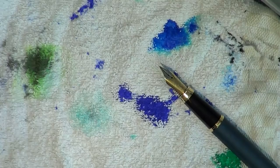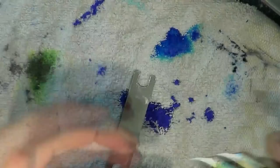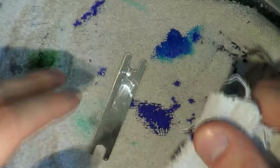Ideally, you would like to end up in a situation where the .002 inch shim is held in the nib slit — just held in there without falling out, which seems to be the case here. And yet, I think it is still a little bit on the dry side. So what I'm going to do now is use a slightly radical trick to speed up the process of making it wetter. I'm going to use a TWSBI wrench, but you can use any hard smooth metal surface.